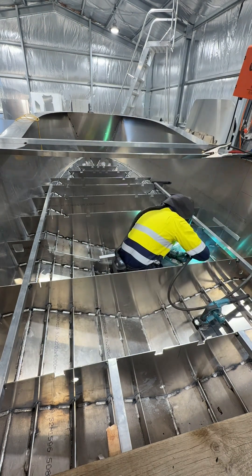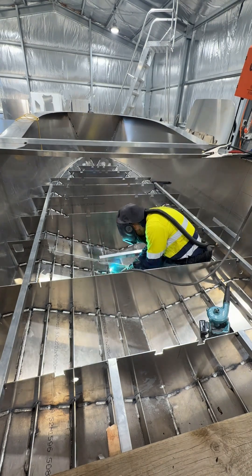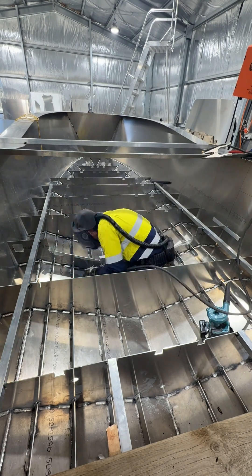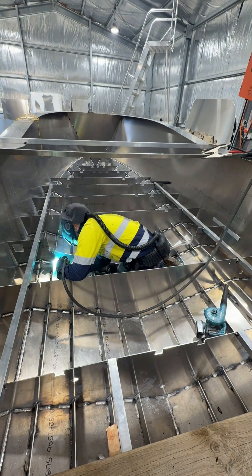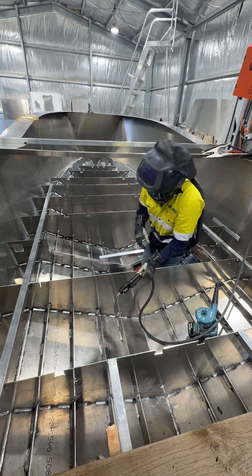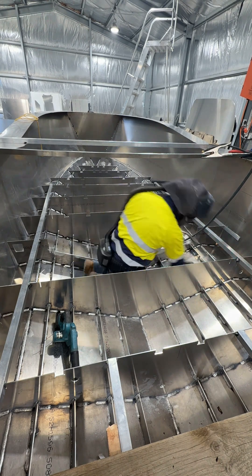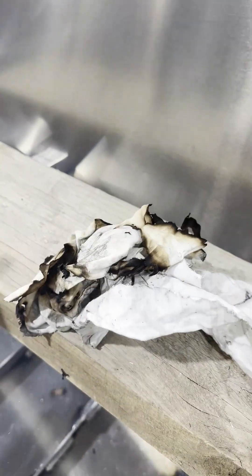I tried doing vertical ups on these originally but it was melting the top edge of the stringer away, so I figured 30-degree downs might be a better option. I was able to verify good penetration, so I went ahead with it. From what I understand it also puts a lot less heat in doing a nice quick weld like that. I did this wherever I could for less structural welds. I also had about 10 rag fires just from leaving a rag on the other side of a plate being welded.